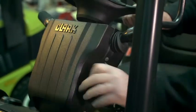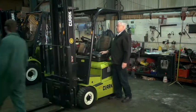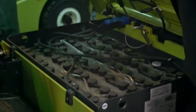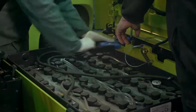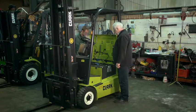Move the steering column forward. Release the locking pin, push the valve lock forward. Once you've done that you can lift the battery cover. Pull the plug to isolate the battery totally and then you can inspect the battery as necessary.